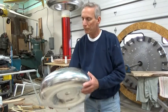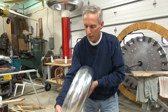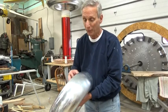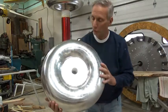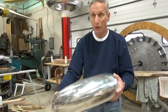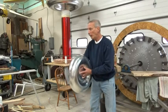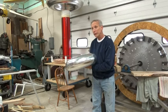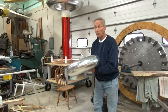Here's the finished result of that toroid assembly. It's covered with aluminum tape, as you can see here. I did try using some steel wool on it to give it a kind of brushed finish, but it looks like hell in my opinion, so I decided to opt for the rest of it to stay nice and shiny. As you can see, it is nice and smooth and very uniform in diameter. It looks like a million bucks when you're five or six feet away. Up close you can see the seams, but as I step away, you would never know this is not a spun toroid. This is very inexpensive, and you can build it just like I did. It's not very hard — you just have to apply yourself and use a little bit of that mathematics and geometry you're supposed to have learned in high school.